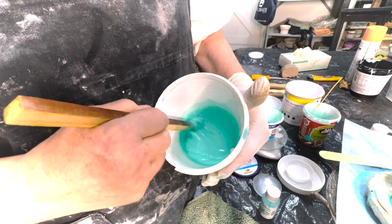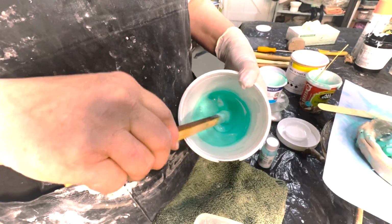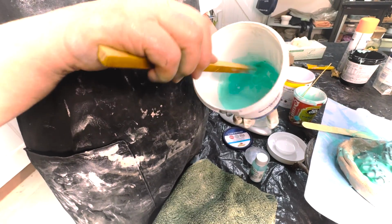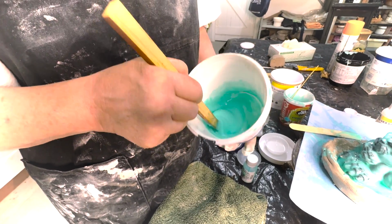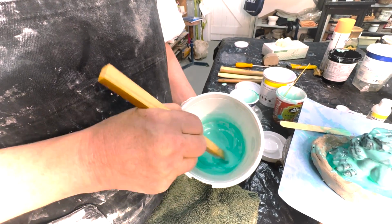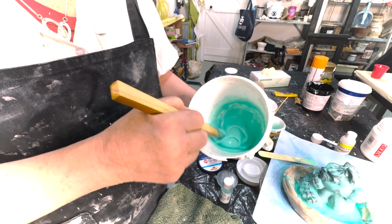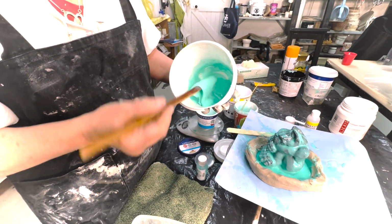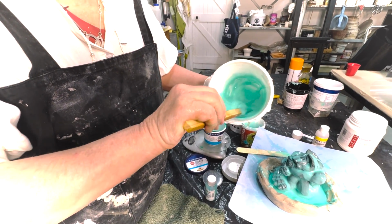But you have to make sure you have stirred thoroughly. If you are unsure of whether you have mixed this correctly, you can always decant this into another jar slowly, and that way you're also making very sure that you've got everything mixed. But I find with the Amsil, because you need so little catalyst, it always seems to mix well. And if you find a little bit of white as you go to the bottom, you just quickly mix it. I've never had a problem with Amsil not setting. You see there are streaks, but there's a good proportion of color in here because you need so little.